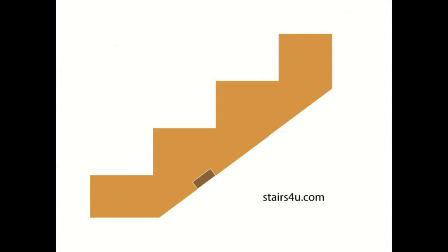Here are a couple of examples to give you a better idea. If the notch out of the stair stringer isn't near the bottom of the stair tread or the back of the riser, it's not going to be as much of a problem. But if you notch the stair stringer near the bottom of the riser, you can see where this would considerably weaken the stringer a lot more than if the notch were moved more towards the middle area.